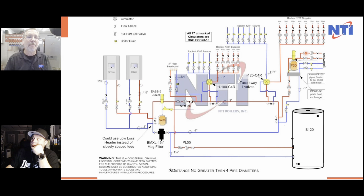And what do we save? Well, let's see. I had a control for this, which was a Tecmar with Wi-Fi. So we had a control for that. We had our zone controller out here for the eight zones out here. So we had two SR504s doing this. I had an SR506 doing this. I had an SR501 doing here on the third floor. No cascading controls for the boilers. No boiler protection out here.